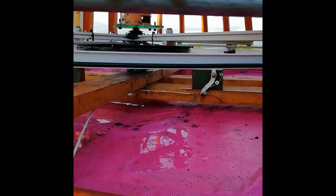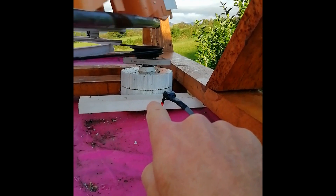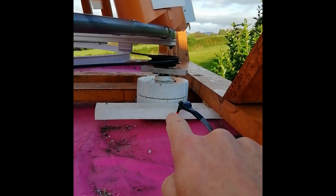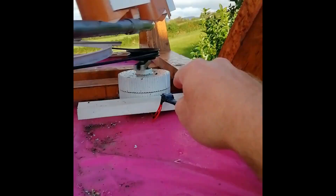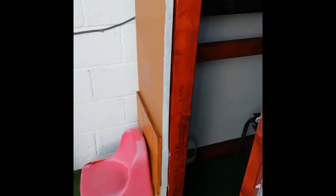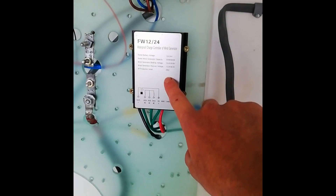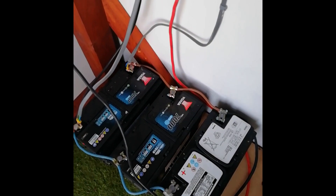It runs on a very simple belt using rubber vacuum tube and an old-fashioned flexible curtain rail. That there is a little 300-watt three-phase AC generator. The three phases are wired coming inside through the wall into the little control room, into this control unit — a rectifier basically — which switches it to DC and charges the battery bank.